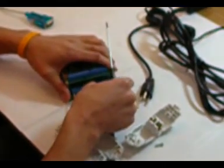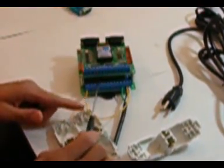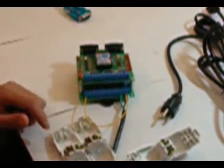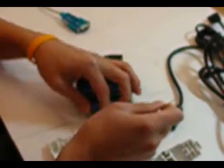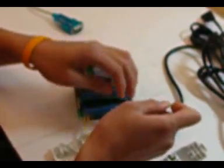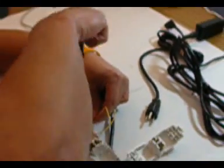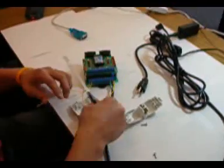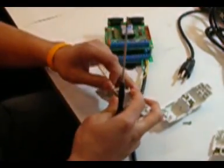Hook up that to the black where it says N. That's screwed in. Now we're going to use P40, P41, P42 — there are three relays on there. So we're going to connect P40 to P40, then connect it to one of these things. Any side is good because polarity doesn't matter again.